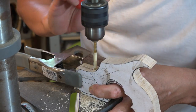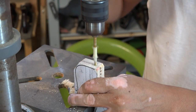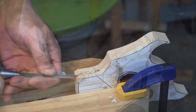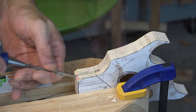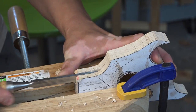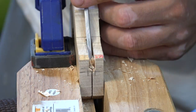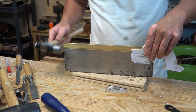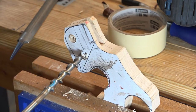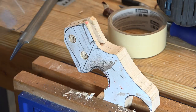I used the drill press to do most of the work when trying to create a space for the spine to fit into. This is where it was important that the reference box be as square as I could possibly get it, otherwise the spine will be angled or off-center. If you're off square by a little bit, I wouldn't worry too much because with hand tools you can always make minute micro adjustments.